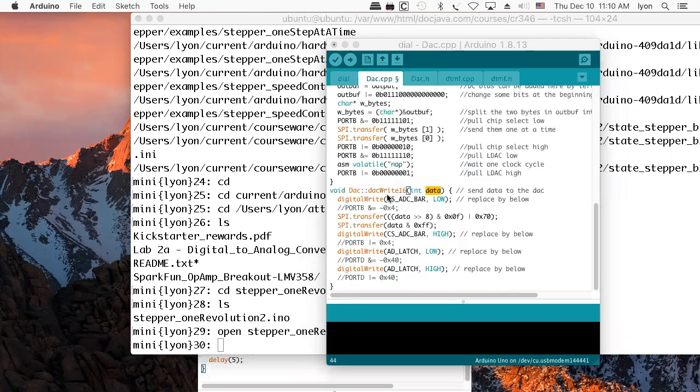Yeah, I use that. I'm just more so asking, sort of like you could play the same notes on a violin or a cello, but they'll still sound slightly different because it's a different thing playing the same note. I'm asking if the output sounds slightly off. Well, it's the dynamic range. It's not going to change the frequencies. Just the dynamic range. So at some level, one could make a compelling argument that yes, they sound the same if you can't tell the difference in the signal to noise ratio. Now, an 8-bit signal to noise ratio will be 48 dB. A 12-bit signal to noise ratio will be something like 72 dB. And if you can't tell the difference between 48 dB and 72 dB because you've got crummy speakers or something, then yeah, it makes no difference.